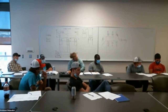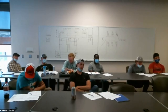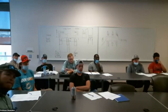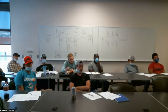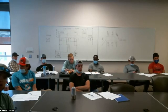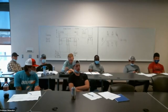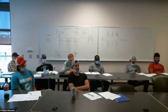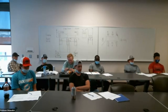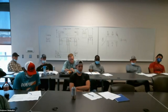One other cool thing out here, I mean, you guys can change the meters out, I'm pretty sure. On three phase, you see this handle right here? First, what's this meter secondary that we put in? What's it going to be? A business. This is three phase, a business. Taco Bell, Burger King, whatever. So you need to come out here and do a meter change, and it's 12 noon. Well, what happens if you pull the meter out? Power goes off.